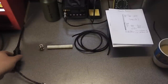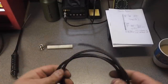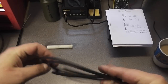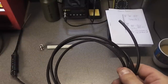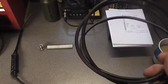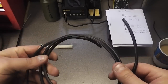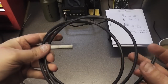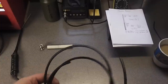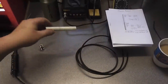What you're going to need is some coax — this is just antenna-quality RG58 with a very high percentage of outer braid. Don't bother using cheap coax with a wispy, thin outer braid, it's not worth it. There's approximately one metre forty of cable here, so it's a very economical build. PMR stuff is a lot shorter than CB stuff, so about one metre forty's worth of cable is what you need.